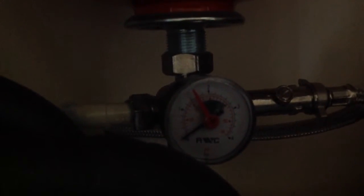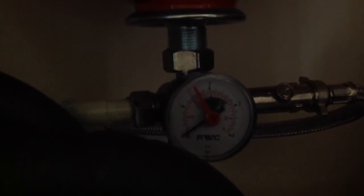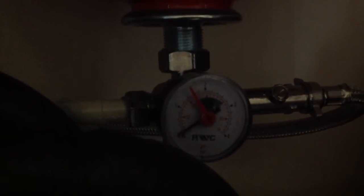So this is a closed system. We use this valve here to refill. I should see the gauge start to go up — there she goes, slowly. It's a good time to go around and just check all the radiators at this point, just in case you've left something open.